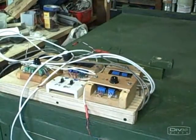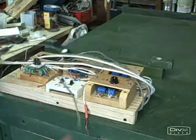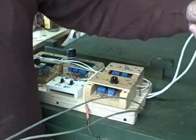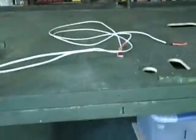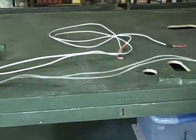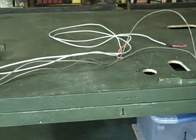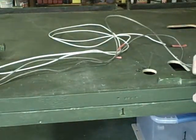You'll notice there's a lot of wires coming out of this electronics board — looks a little confusing, so let's deal with that. Coming out of the side, we have four wires: two are gray and two are white. The white wires will go to the collector, and the gray wires will go to the storage tanks and the pumps — the terminals. Inside these cables there's a number of wires; some are wired to the controllers so they'll sense the temperature and also regulate the pumps.